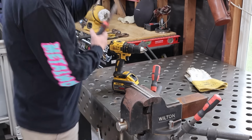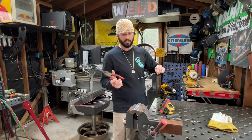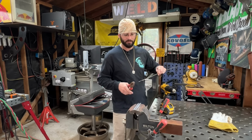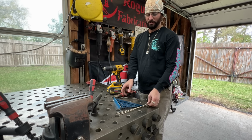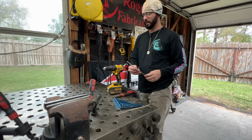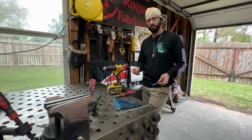For this, I only have these 2 pieces of 3/32 wire, so I'm going to end up actually cutting them in half. You can get a lot of bracelets, probably 3 or 4 out of one full rod of twists. Twisting your wire can be kind of trial and error. There's plenty of times, as you saw this inconel one, that popped a lot quicker. I found if I'm able to use a full length of rod, I can usually twist it a lot more than if I have a shorter one. Same as different grades of stainless. It's not that complicated. It's just a bracelet.